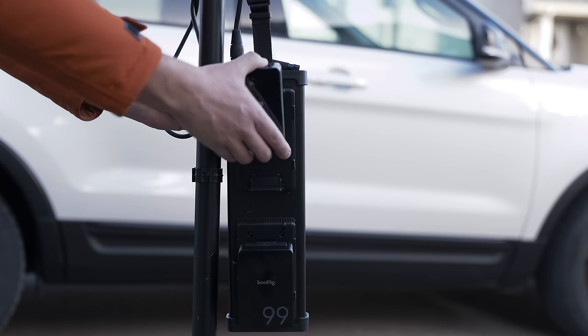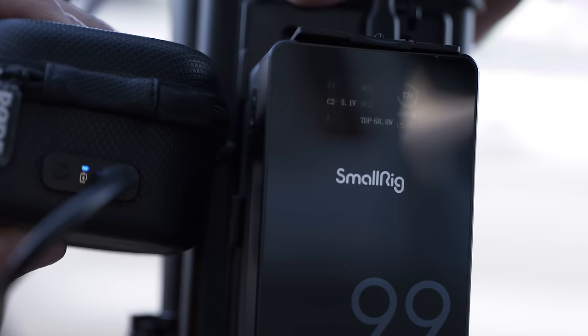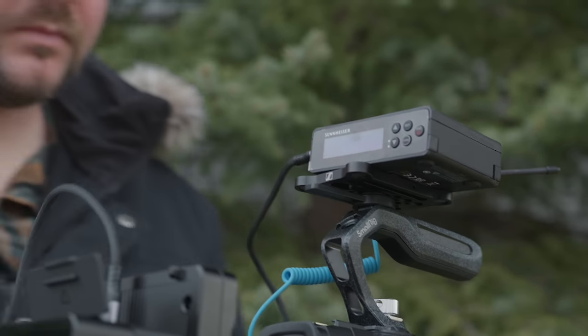Jordan, you can see how insanely versatile these little batteries are and how they go well beyond just our old classic V-mount batteries. We can charge multiple devices, power multiple devices all at the same time, but they're still classic V-mount batteries as well. We can throw them on a high-powered LED, run that LED — it'll tell you how long you can actually run it for. And if you've got peripherals you still need to charge, maybe USB-C battery charger or some microphones, you could just plug in USB-C while it's powering your light and do all that at the same time. And it's a great safety net because pretty much every modern piece of equipment we use, you could just run off USB-C right off this battery.